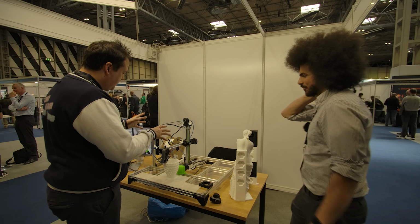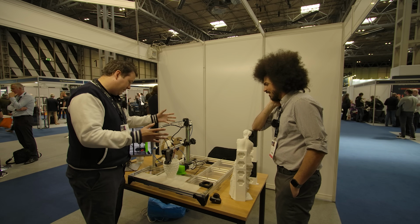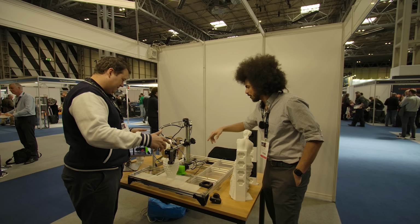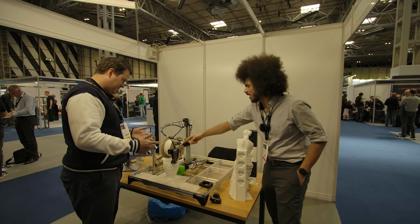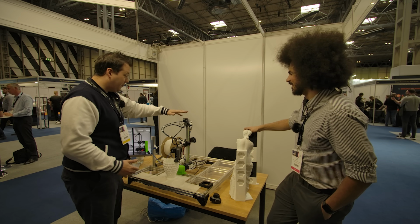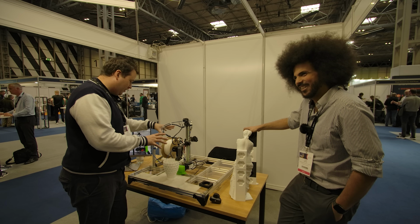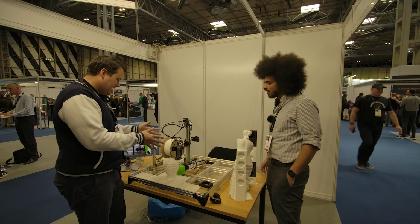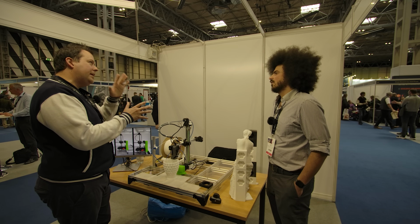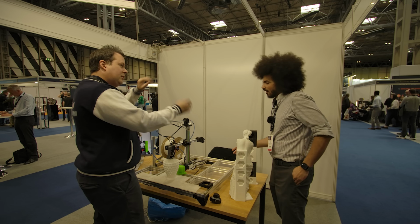I mean, this in and of itself is a contextually complicated design, right? Because we've got a cantilevered X, if you want to call it that. We've got a rotational Y, I suppose. I call it alpha, alpha for the angle, radius, and then Z. Yeah, Z is contextually traditional. It's a reverse C, because your C is at the top rather than the bottom. And then the kinematics of this is, I guess, kind of similar to a CoreXY, but it isn't, because the A and B, or the radial and the axial, are still independent of each other.